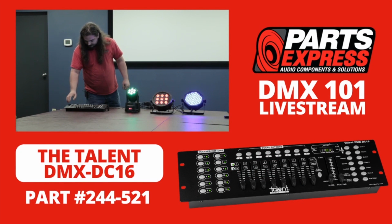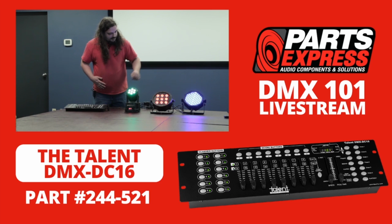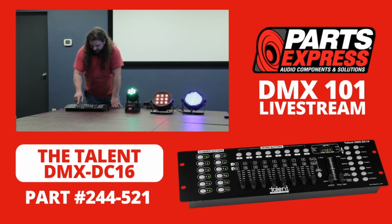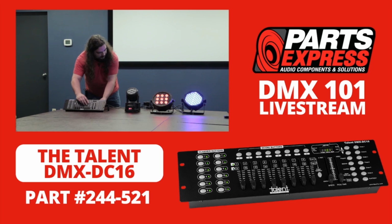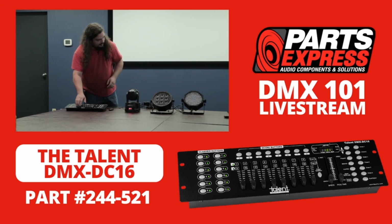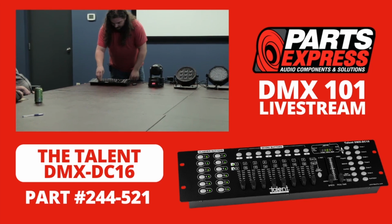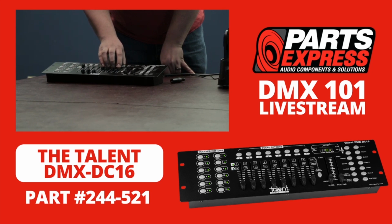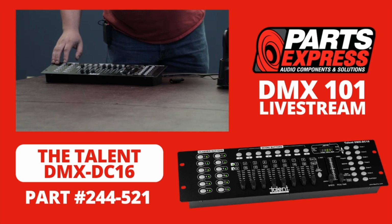So the way this works is channel one, or starting address one, is going to start right here on this fixture one, or scanner one. So here, let me reset the board, make everything go black again. I believe I set this one to start at one. I remember this light, the first channel is just a dimmer. So nothing's happened now. And the last four are my colors. Would help if I selected it. So I bring up the master dimmer. Now I should be able to bring up red, green, blue, and an individual white. So that's how I've got the first one going.